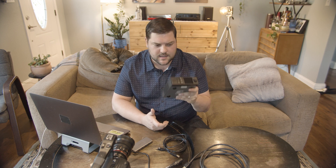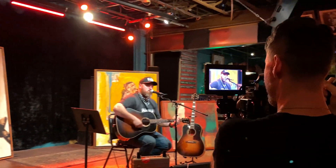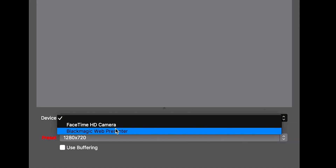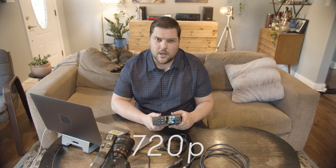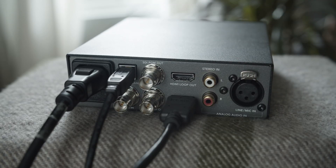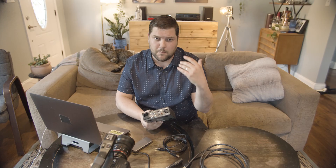This box is great. It's going to take your DSLRs, your cinema cameras, any camera you might own, and transform it so that your streaming software recognizes that camera as a streaming device. It's also going to take your signal and transmit it in 720p, which is essential for streaming right now because it lessens the amount of bandwidth being absorbed. As far as inputs go, we have an HDMI and an SDI, and it also has loop outs of both for whatever you might be using as a monitor.